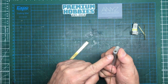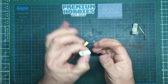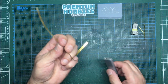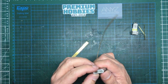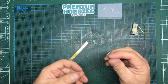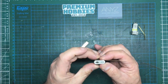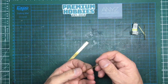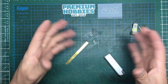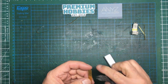Here's the problem: you've got a piece of brass you need to go around a shape — say the top of a funnel. You put some super glue, hold it, roll it round, hold it, clamp it all in place, let the glue go off — and that's fine. But after a couple of weeks, it pings off, because the glue is under constant stress as the brass is always wanting to spring back. If you anneal your brass, it holds that shape and there's no stress on the glue whatsoever.